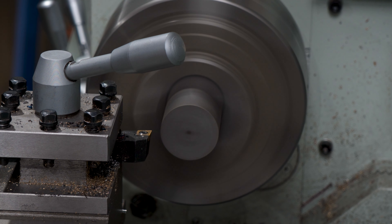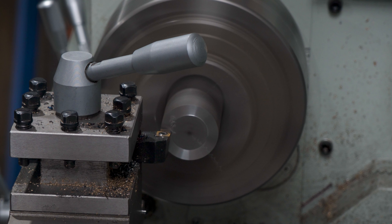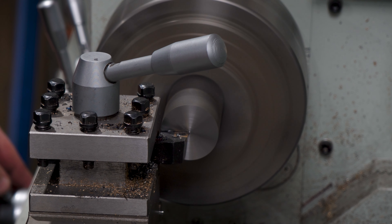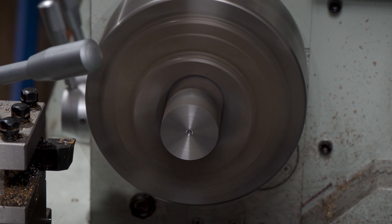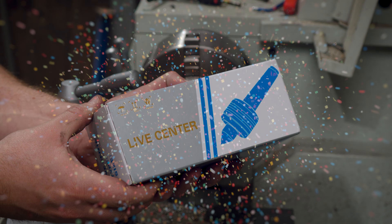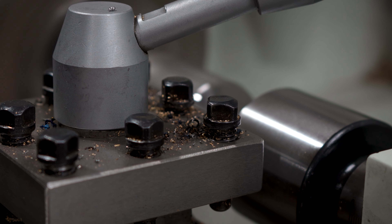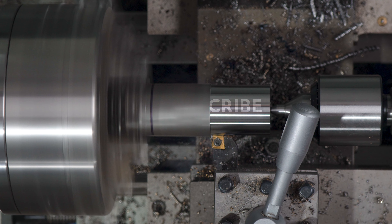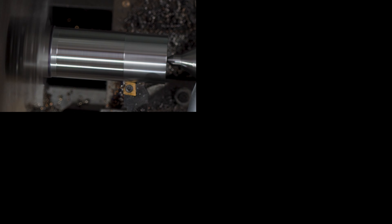I'll start by chucking up a chunk of 40mm or inch-and-a-half-ish 1045 round bar in the lathe. I'll start by facing and centre drilling the bar, and I can bust out my big purchase for the week — I finally got myself a live centre. With some proper tail support, I can bring the bar down a couple of mil. I don't want to take too much off here; this is only going to be a small hammer and I want to keep as much of that mass as I can.